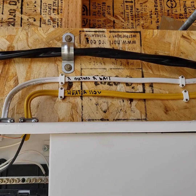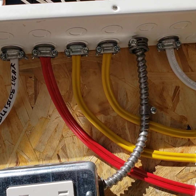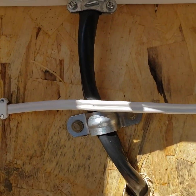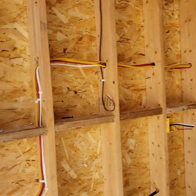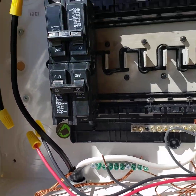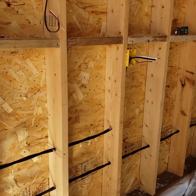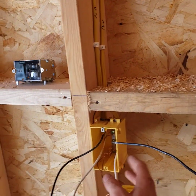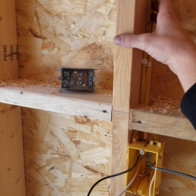I used a permanent marker on the actual sheathing itself. When you terminate wires in the boxes and panel, you need your clamps on there — these are 3/8-inch clamps, and this was a 3/4-inch for my 6-2 wire going to my two 50 amp outlets — one for a compressor and one for a welder — with dual-pole breakers. You'll need the larger clamps to secure those wires into the panel.